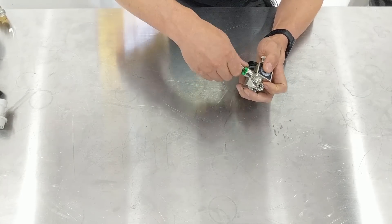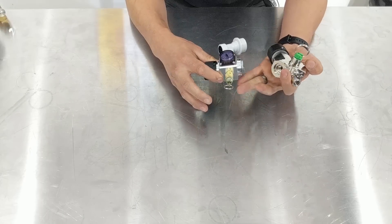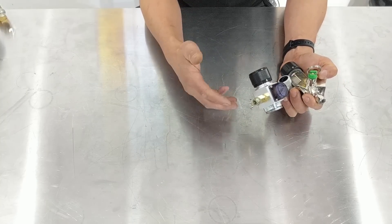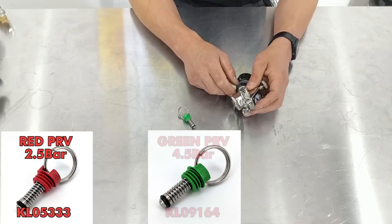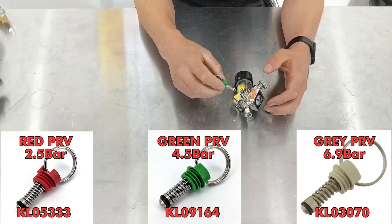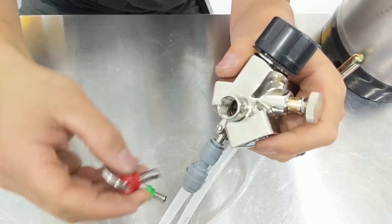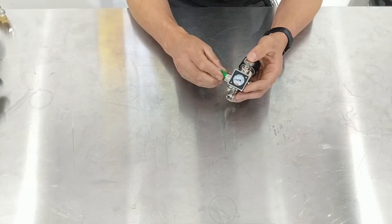The other thing you'll notice is it's got a handy safety pressure release valve. If you look at some of the other regulators, yes this one certainly has a pressure release valve, but what's it actually set to? You don't really know. It's also not easy to change if you're going from a growler with a low pressure limit to a keg with a higher pressure limit. But these ones are all color coded, so you can whip that one out and get a gray pressure relief valve and screw it in. We've tried to keep all the parts as common and compatible as possible — you get a keg gray pressure release valve or our red one which only goes to two and a half PSI, and they're the same ones used in our Fermzilla, kegs, mini kegs, and other products. So even though it's a mini size, it's still using compatible parts to our larger regulators.